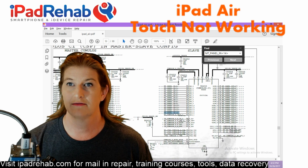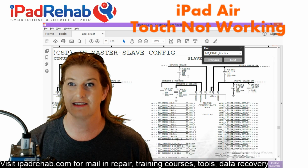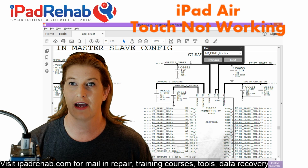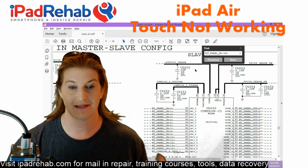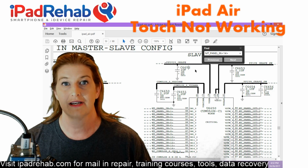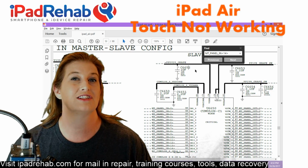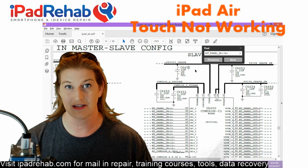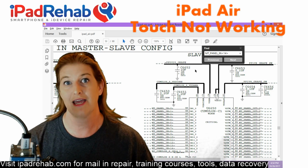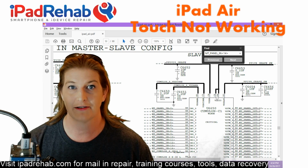So the first thing that we should do is let's just pick this PP5V25 grape. So let's pick a cap, C6652, and see whether or not it's present. So we're going to set up this iPad kind of how it is right now. We've got a screen, we've got a digitizer attached. Now my guess is that I could detach the digitizer because I didn't see any line there on the digitizer connector that would tell the CPU anything like, hey bro, there's a screen attached. So I think I'm probably going to be safe to take it off in order to take these measurements.